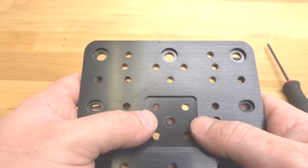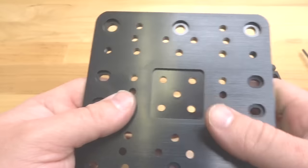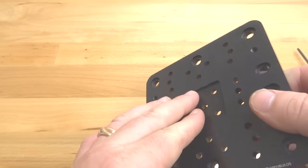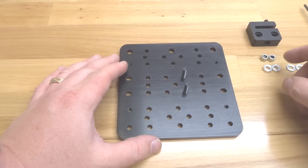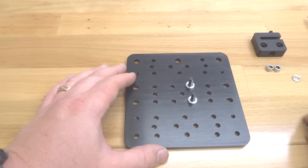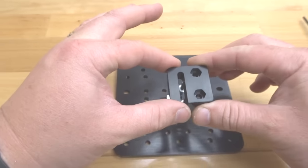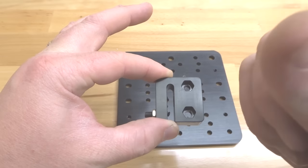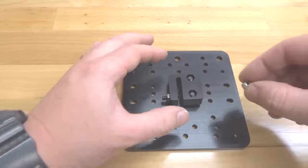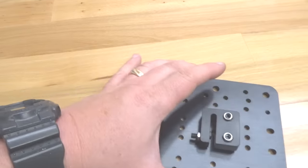Take notice of the center holes where we're going to be placing our anti-backlash nut block — in this case in these two holes. Go ahead and run both 20mm screws through the plate, rotate it around, and take your 3mm aluminum spacers and place them on top of the screws along with your precision shims. Take your anti-backlash nut block and place it on top with the hex design holes facing upwards. Place your nylon hex nuts into the grooved holes and tighten the system down.